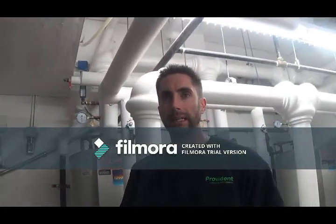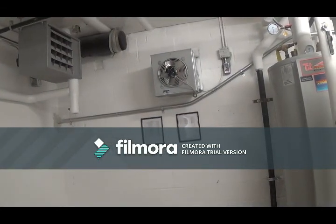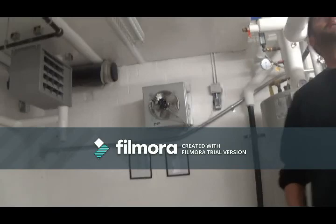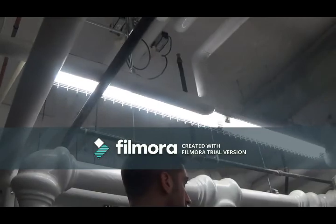So what does that say over here? Element return. So bare element. Come summertime, I would isolate those, because even then they dissipate heat through. The water comes from the boilers, going to these fin and rad tube heaters, the bare element heaters. Remember I told you about the hot water pumps supplying the heaters and all the miscellaneous? So this is called miscellaneous heating.